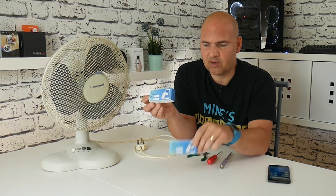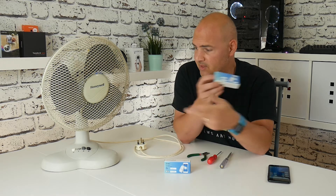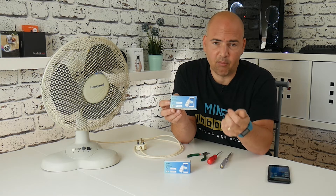Realistically, I would say these particular switches are best for controlling lighter loads, things like light switches. In this case I'm going to be using a desk fan. I wouldn't be tempted to use it for a kettle or a toaster or other higher load appliances, purely because the max current is 10 amps and most of those devices in the kitchen are going to be sort of 15 amps or above. So try and use it with a low amperage or low wattage appliance and you should be absolutely fine.